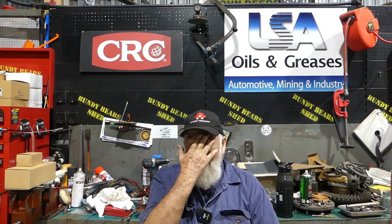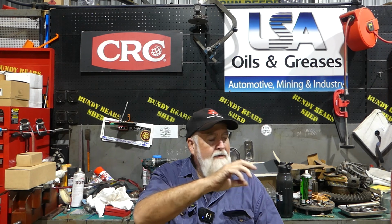And then I'm going to put a bit of, like the poly pipe I use coming into the shed, so later on I can just lift it up with the forklift, prop it up, or just undo the fitting and undo the plug, you know, the power lead. I'm running a 32 amp 3-phase power lead to it. It's just what I had on the wall, so I adapted the compressor from a 20 amp to 32, I think it is. So anyway, that was a bit of excitement for the week.